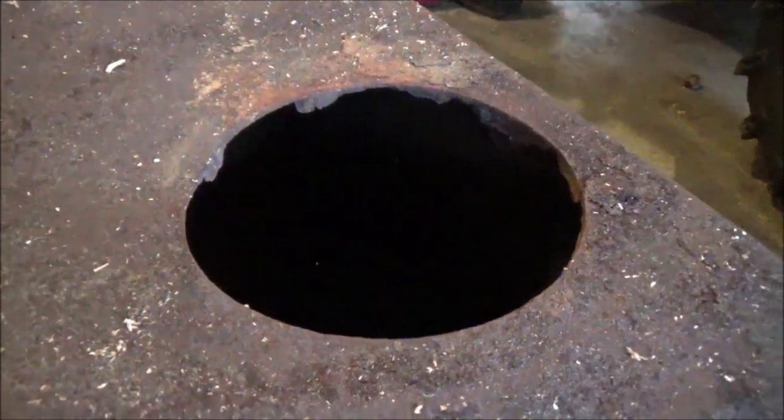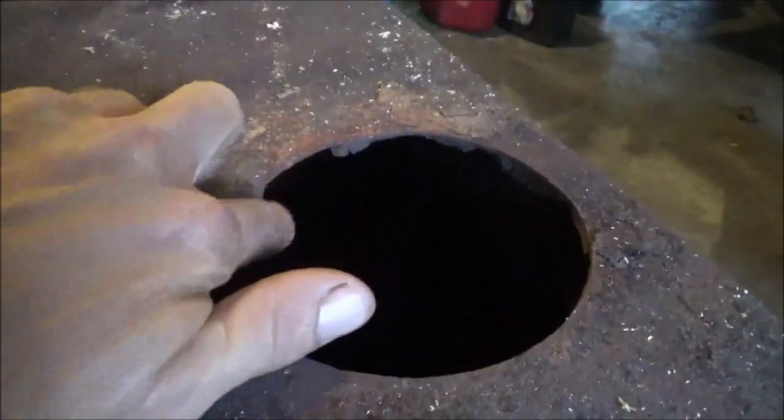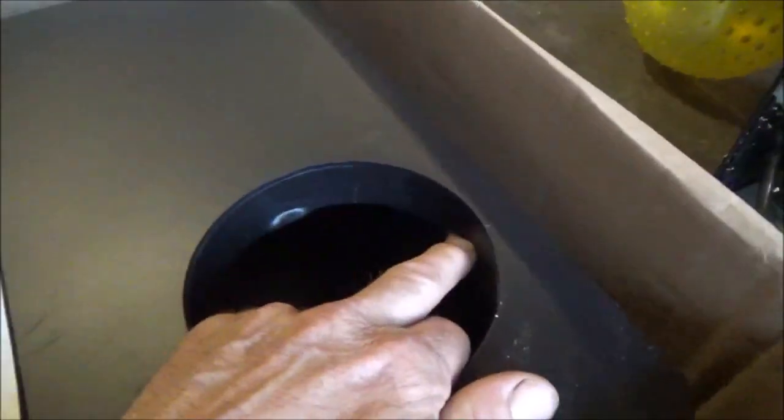One thing I noticed that they do different compared to the original — you can see how this is in here. With the new stove, they've got this lip that goes down and then these little things here to catch the stove pipe. The old way, it was just that rim on the stove pipe that would catch right here, which is fine if you're a normal person and would always replace your pipe when it got bad. But for me, I'd use them until they burn out. I remember one time I opened up to put wood in and couldn't get the wood to fire — a longer log — and my stove pipe had actually sunk down about three or four inches. My own fault, but this here is nice because it'll stop that stove pipe and it won't go down at all.